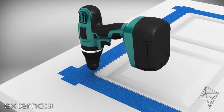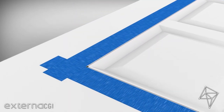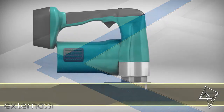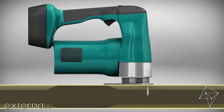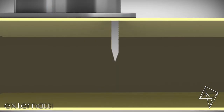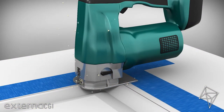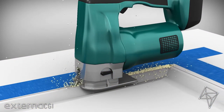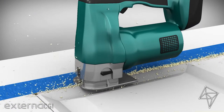The tape will act as a guide for cutting the hole and protect the finish of your door while cutting. Using a three-eighths inch bit, drill starter holes for each corner of the new opening. Now you're ready to cut the door glass opening. Determine the proper blade size for your jigsaw — the saw blade should not protrude at its downstroke and should not come out of the door during its upstroke. Using the starter hole, insert the jigsaw with a short-stroke blade into the inner core of the door and cut along marked guide lines from corner to corner.